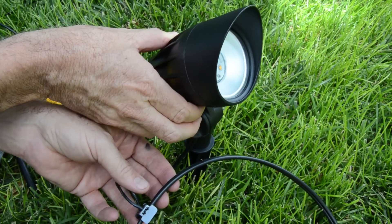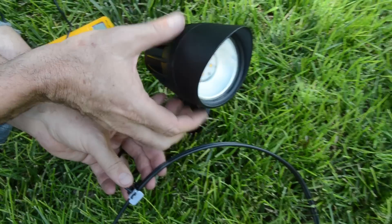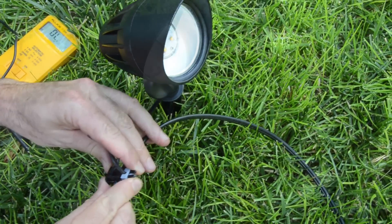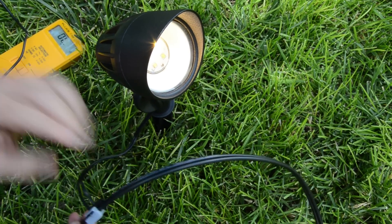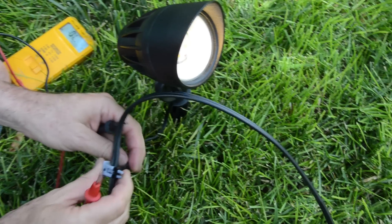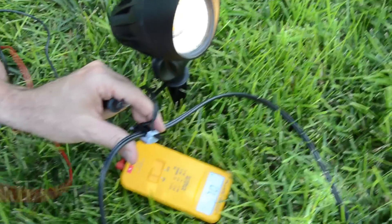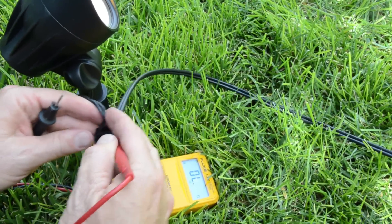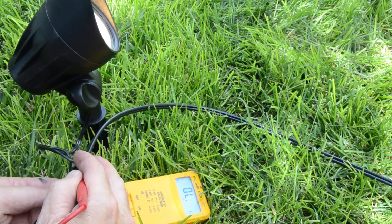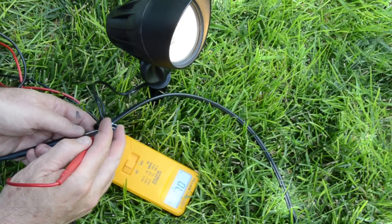This is our largest and most powerful LED light — a 15-watt LED equivalent to a 50-watt standard halogen landscape light. Of course, you won't be replacing the bulb. Using the Malibu quick connect, we push the connector together. We've added this fixture at about 100 feet away from the transformer — our total wire length is 150 feet. Out in the field we're measuring voltage to see how much loss we have, and most likely it's still in the acceptable range.